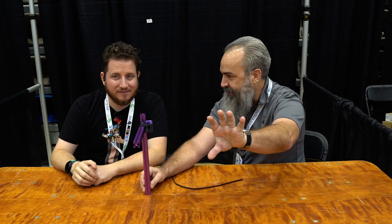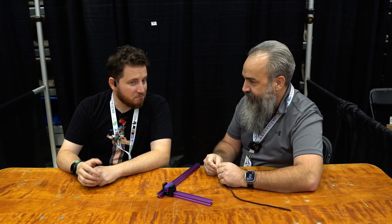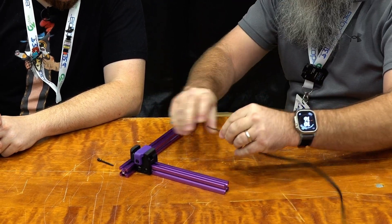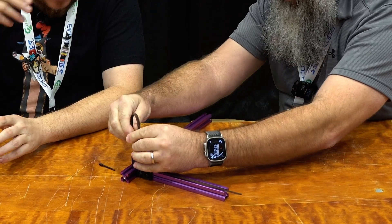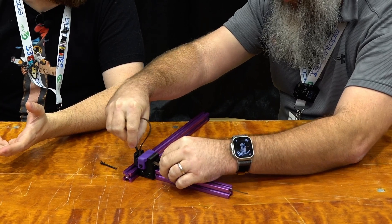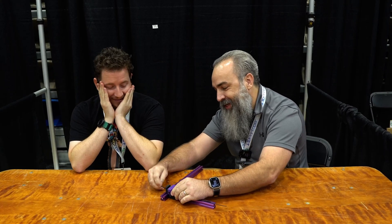So if you imagine this is the front of the printer, and your tool head is here — the thing that chat was probably yelling at you repeatedly to do is remove the tension screw completely. Coming from the tool head, through this side, like this — now back through. Give it a little bend so it can get through the corner. They told me to use some sort of a zip tie thing, but it just threads right through. And it's done — then you can put your tension screw back in.